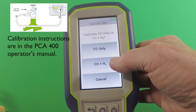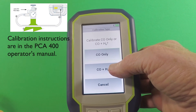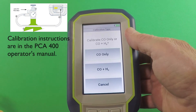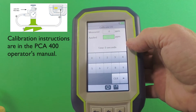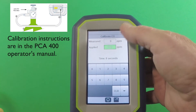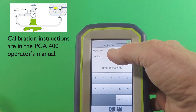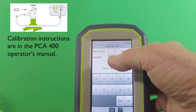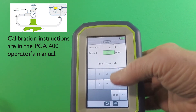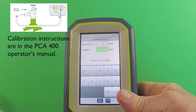Generally, you calibrate these with, say, 500 ppm CO, and then you would have another tank of 1,000 ppm CO with 1,000 ppm hydrogen — that gives you more accurate carbon monoxide readings. Let's say we just wanted to do the CO only. The applied number is whatever your tank of gas reads; it just defaults to 500. You would hook the calibration gas up to the instrument. Measured is what it thinks it's seeing; applied is what's on your tank. After about three minutes when the measured number stabilizes, you just hit enter and that calibrates the instrument.